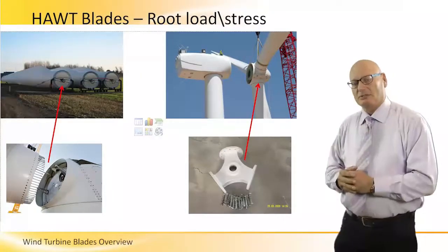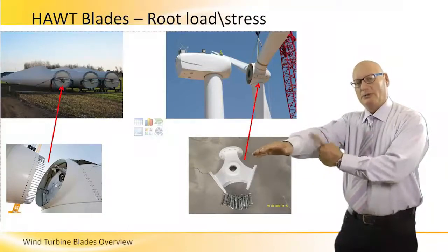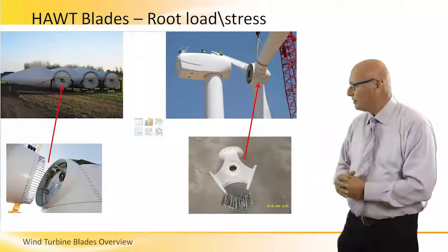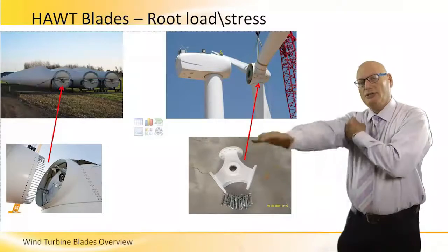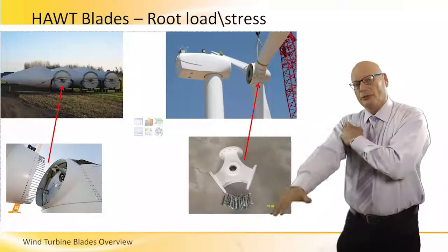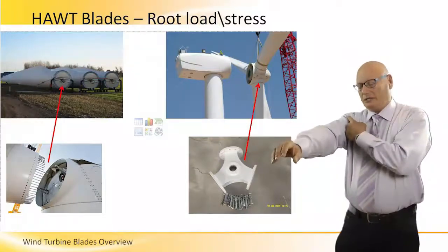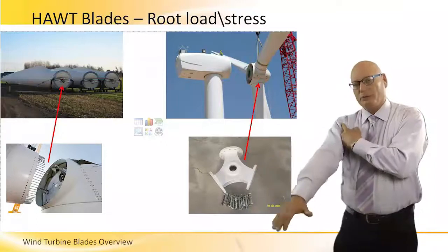This 120 degrees central device assures that the shaft will be in the center, assured symmetry, but there are three weak points. The center of gravity, as we said before, is so much away from that particular device in the center, in the right bottom corner, that it creates a moment. It creates shoulder effect forces. And the problem is not only that particular effect of having that weak point.